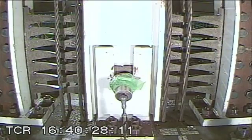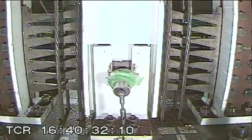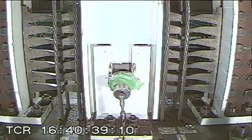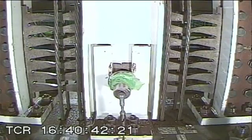The yielding and energy dissipation will occur in these specific fuses that can be easily replaced after an earthquake. The fuses in our buildings — one that we developed here at Stanford — are steel plates where we use water jet cutting to cut what look like butterfly-shaped links. When you see the fuse deform, it's like fingers that are moving up and down, yielding the steel, and by doing so, dissipating energy.